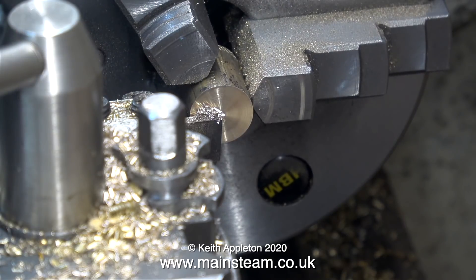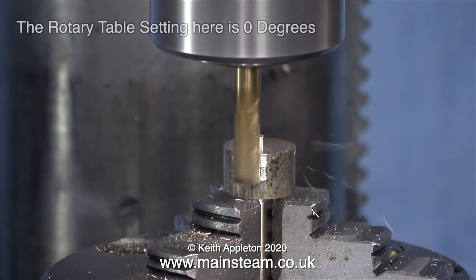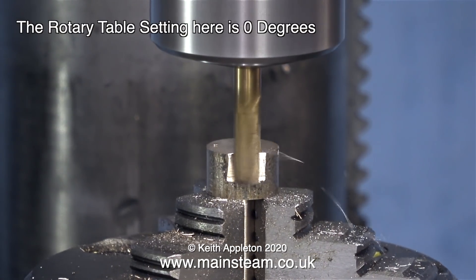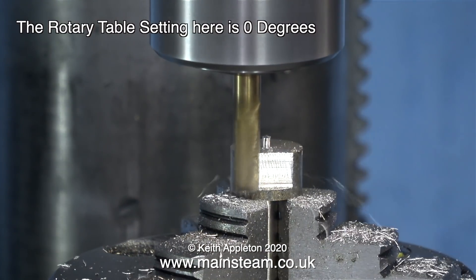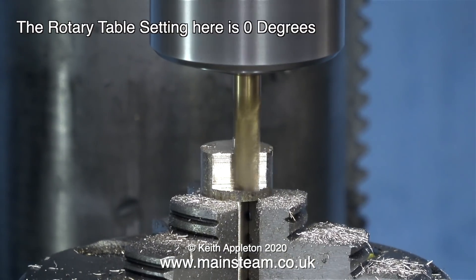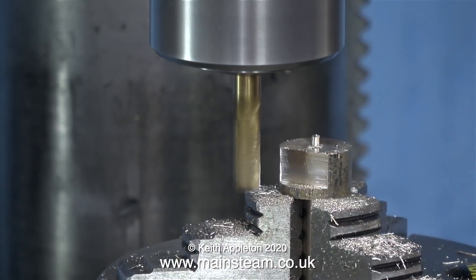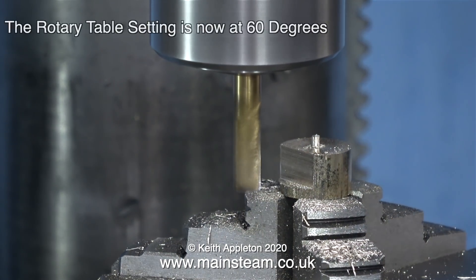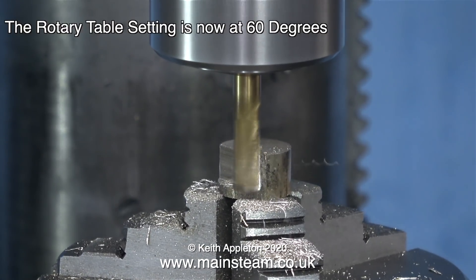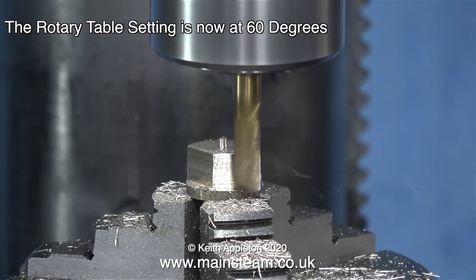For the next part I need to enlist the help of my rotary table on the milling machine. I set the rotary table to zero degrees on the dial. I had to use telephoto because I couldn't get the camera into the normal place, so the camera angle is a little bit strange, but it easily demonstrates the principle. I'm controlling how much metal I remove from the bolt blank by reading the graduations on the hand wheel of the cross slide of the milling table. The depth of cut depends on how big I need the head of the bolt to be.